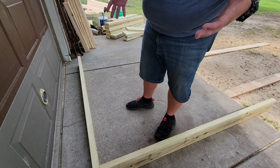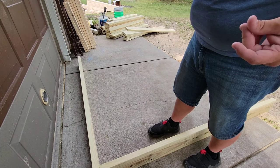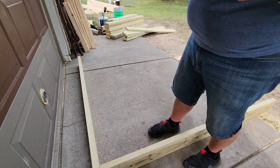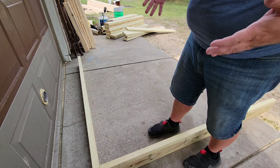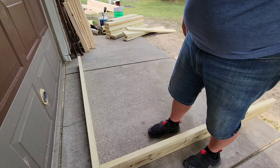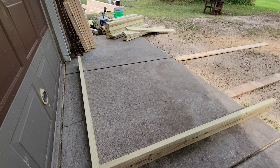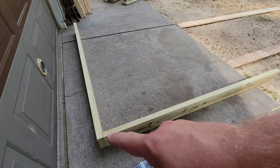I don't use construction adhesive unless I'm using reclaimed or three-quarter-inch plywood cutoffs — then I'll use construction adhesive to make sure it's stuck down nice and tight. Remember, when you cut the sheet you'll cut two feet off the end to get your six-foot-long sheet for a six-by-six, which gives you a scrap piece you can use for another stand if you plan your materials accordingly. I'm going to show you how I attach those corners and then we'll go from there.